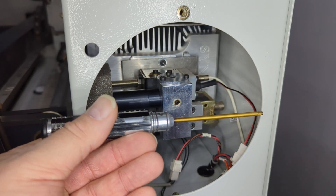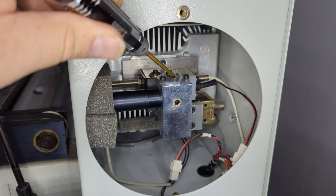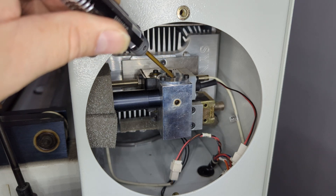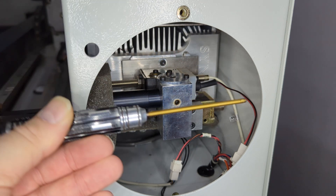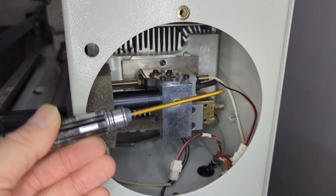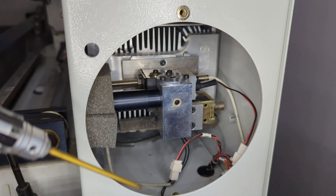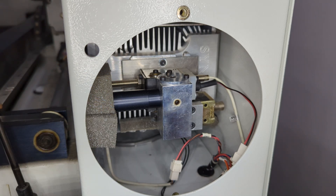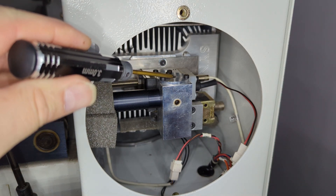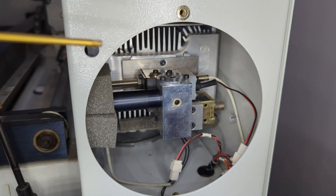So that's your coarse adjustment. Once you have that, you can then use these two screws on the top — there's one in the center and one right next to it. Doing up the center one will actually pull the lens up, and doing up the other one will push the lens back down. They compete against each other, so it's important that one is loosened off before the other is tightened, otherwise you could potentially cause damage. These are only for extremely fine adjustment — looking at the internal mirror assembly, you're flexing a cut in the aluminium, so if you adjust it too much it'll snap off.